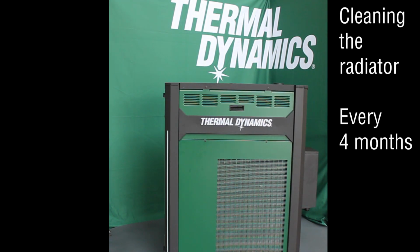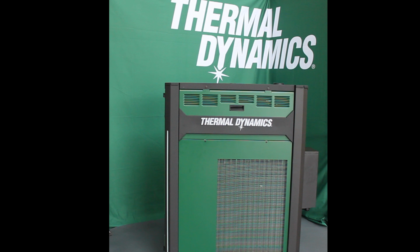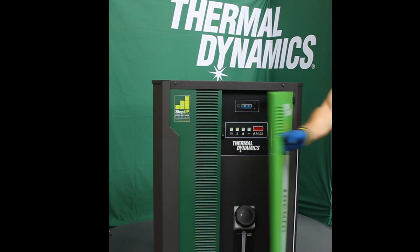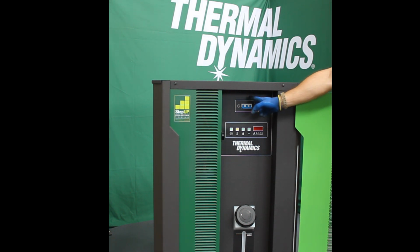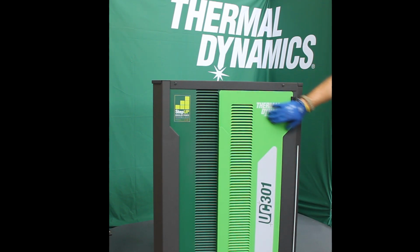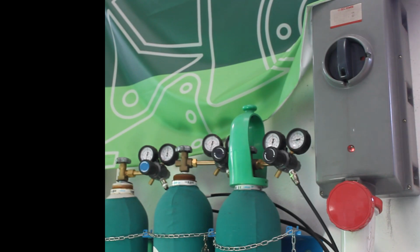Cleaning the radiator. Suggested every 4 months. Always use proper safety equipment to protect you and others around you. Start by powering off the plasma and switching off the main power. Make sure that the power is completely disconnected from the plasma before removing any panels.